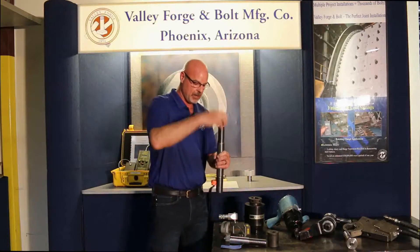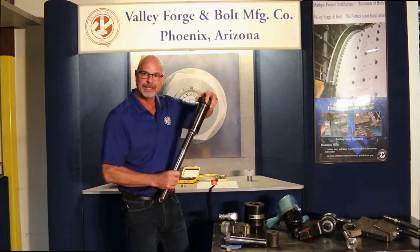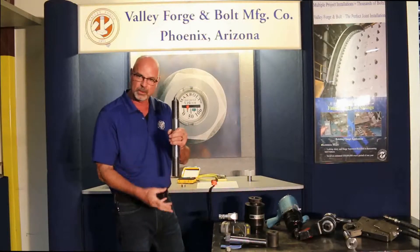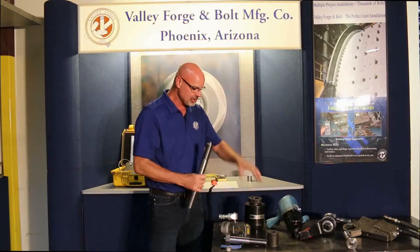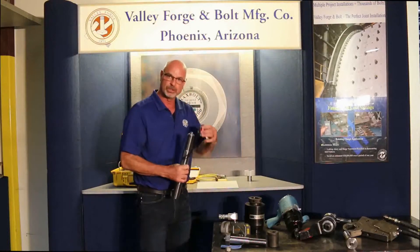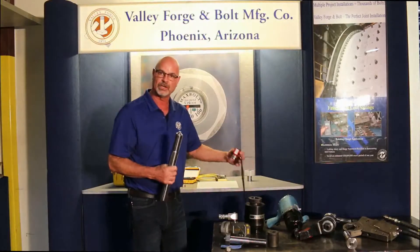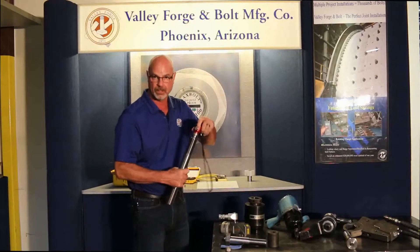Say we're connected here. With a tensioner, you're probably not going to be able to read an SPC4 that is mounted in the ground or into a piece of equipment while tensioning it from here. Having the tensioner on it, you're going to have to put your load on it to the design of the OEM — whoever's selling you the tensioner — to reach that load you're looking for.